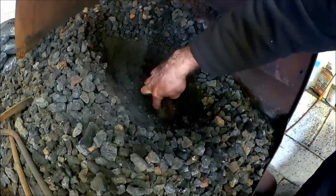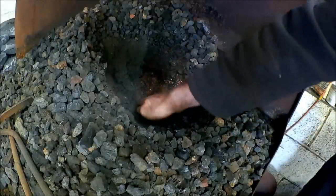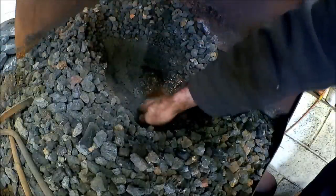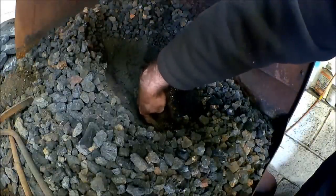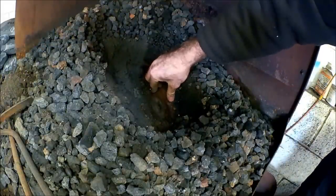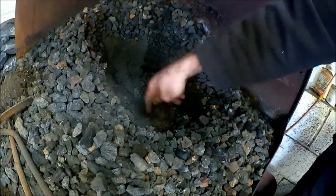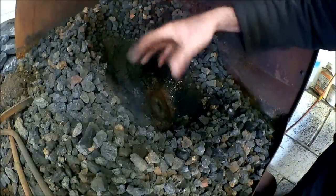A lot of people dig it out to the point where they see the hole and go, 'that's enough,' and start building their fire. Wrong, in my opinion — dig even deeper, get right down. Remove some of that sand; you need a good couple of handfuls. Go down about 50mm below the hole. The reason is when you're blasting air, all the sand and crud builds up at the bottom. If you haven't got a place for it to go, you start blasting sand, impurities, and rubbish back onto your piece, making it very dirty and unable to fire weld.